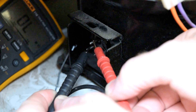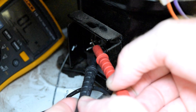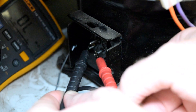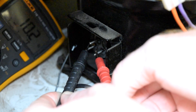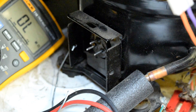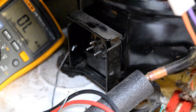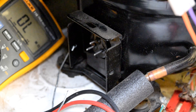What we're looking for here is that the first two tests should add up to the third test. 4.4 and 6.2 should add up to 10.1 or so — it's in the ballpark. What we're testing there is the resistance for both the run and start winding, and essentially that's testing the motor inside the compressor, whether it has good continuity.